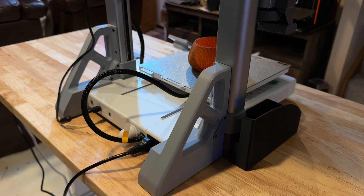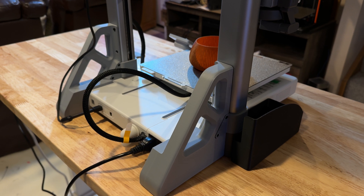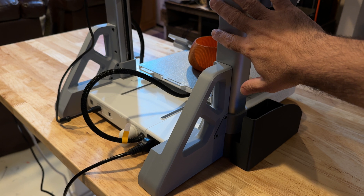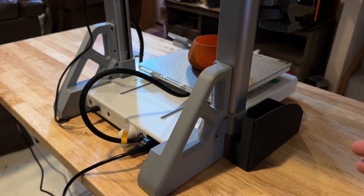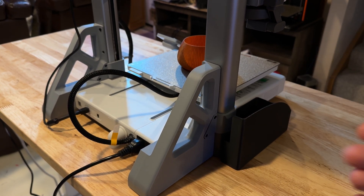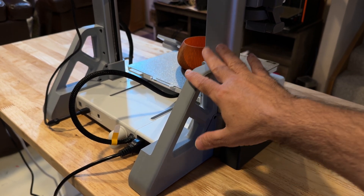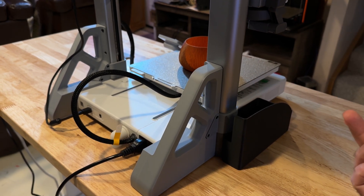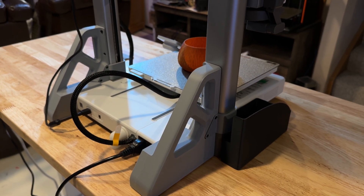You can print a lot of different materials with this — not just PLA, but PETG and others depending on the nozzle. One challenge with this printer is that it's an open frame, so materials requiring better temperature control can be difficult. In my space it gets really cold, so I'd see a lot of curling. I mostly stick with PLA. Materials like PLA-CF or nylons may not work well since it's not enclosed like the printers behind me.